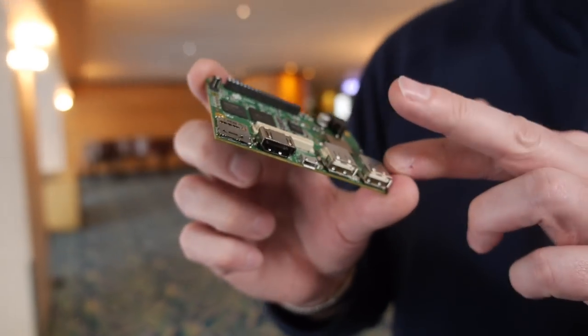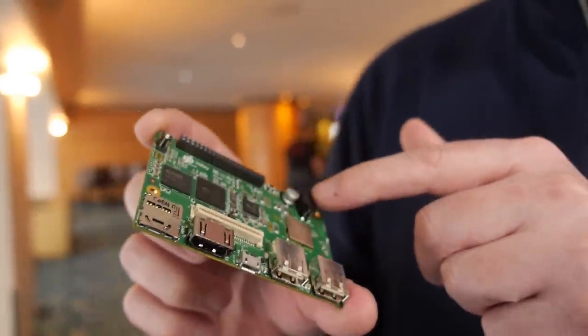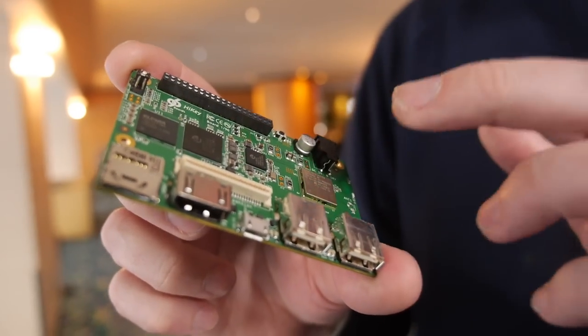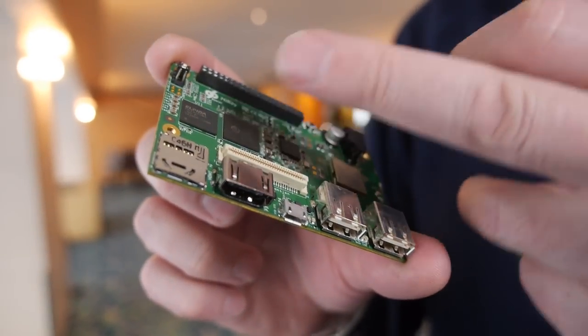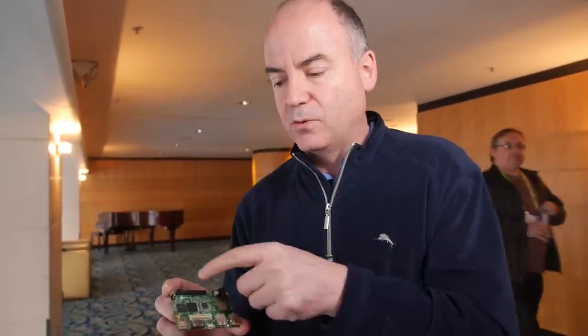You do have to keep within the height spec. The other really nice thing about the Type-C connectors is the power supply. We've been asked why we don't use micro USB for power — the reason is that with these high-performance SOCs, you can actually exceed the available power from a micro USB port, which can result in brownouts. So you do have to power the board from the external connector or the expansion bus. But when we get to Type-C USBs, they can carry a lot more current — you can put them in either way up, and you can actually power the board just from a USB port.